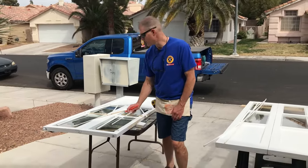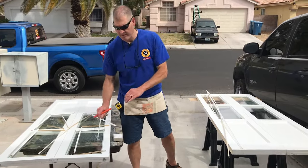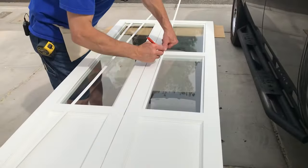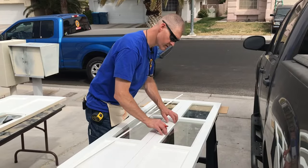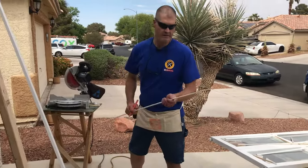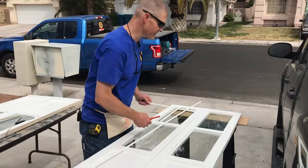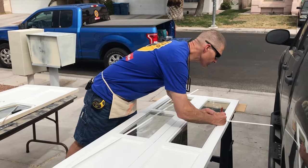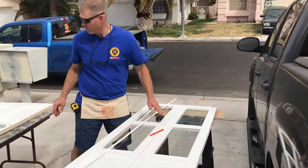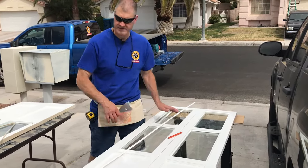To install the glass, we've set them all in their holes — all eight panels are fitted in their holes — and we're cutting the stop. I'm going to mark it in place. The process we used: cut one, marry the next one, custom cut it, work our way around — that's how we cut all the stops for all the windows. We'll move the stops, lift the glass, put down some silicone, put the glass down on it, and then attach the stops.